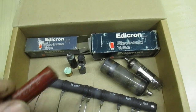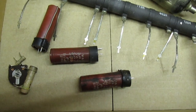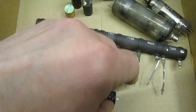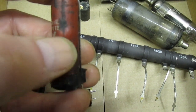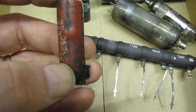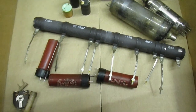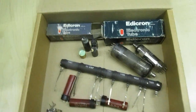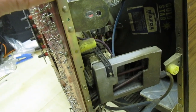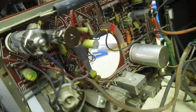This capacitor here I've changed because it had intermittent fuse blowing. There are two capacitors there — they actually test all right but they've had a very hard life and one's got a distinct bulge in it, so even though it tests all right and works fine in the set, I've actually put some Mullard Mustards in. Let's move over to here — that's the EHT tripler there.